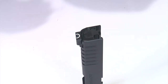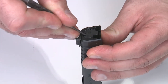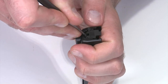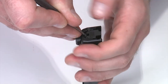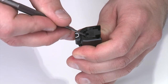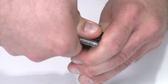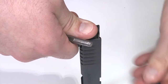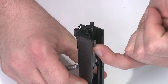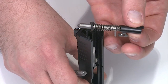To replace the striker spring, first remove the back plate from the slide. I'll use my pin punch and push on the little rectangular block at the top, slide the back plate down just a little bit until it clears, then push the back plate off. Remember your extractor tension also comes off this, so both springs will want to pop up — put your thumb over the top and expect it to push back as they pop up. The back plate comes off and now the two springs are de-tensioned. I can take my finger and pull the striker up and out to disassemble it and put the new spring on.